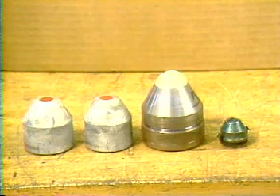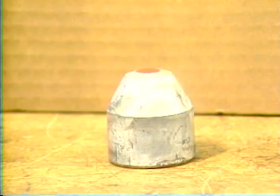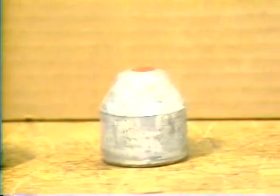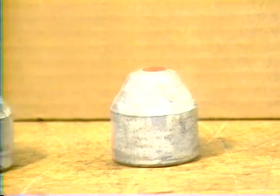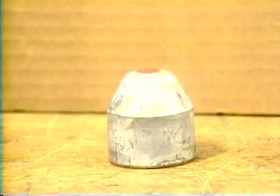There is a zone of crushed rock around the perforation, and the precise shape of the perforation will vary somewhat, depending on charge geometry, gun positioning, and target characteristics. For example, although the exterior of these charges look identical, this charge is designed to give large diameter perforations for easy gravel packing, while this charge is designed to penetrate deeply with a somewhat smaller entrance hole.